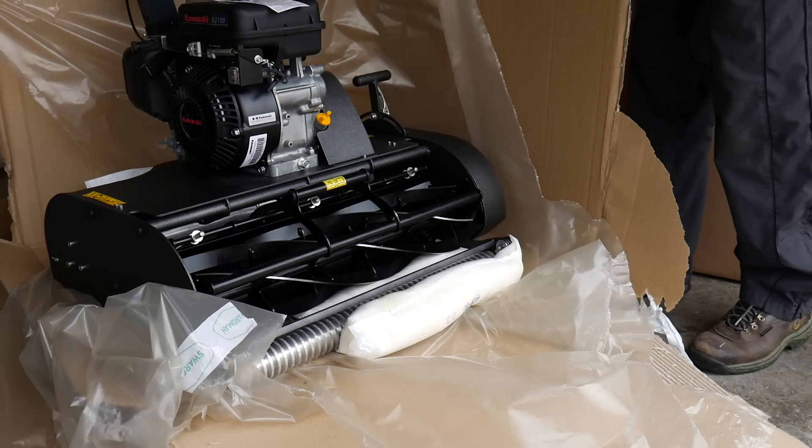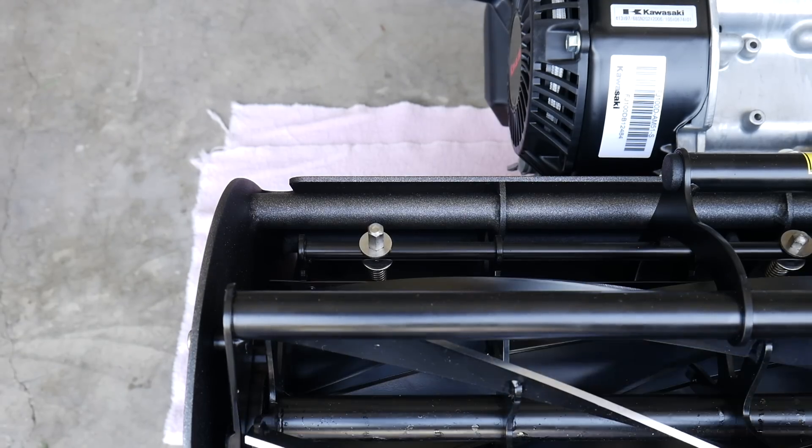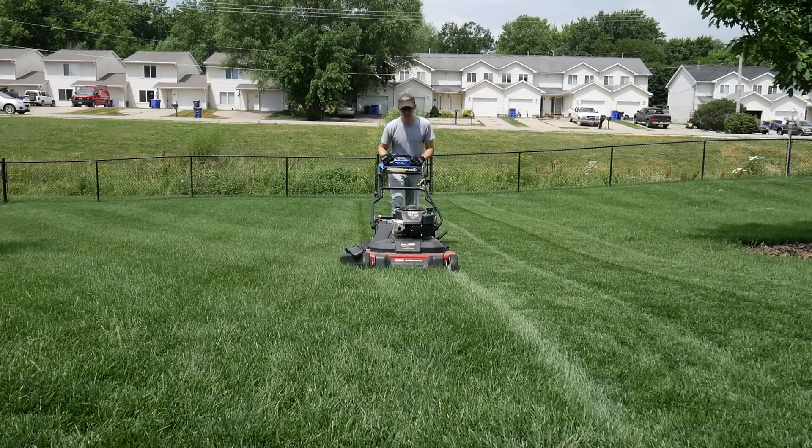One of the first questions I received was: what are the differences between a reel mower and a rotary mower? The way this thing works is we have that reel of blades and a little flat piece of metal underneath called the bed knife. When the reel spins around, the grass comes up on that flat piece of metal and it cuts it off pretty much just like a scissors. A rotary mower spins around and cuts off the grass, but it's more like ripping off the top of the grass with a blade. That's why it's very important to have your blades sharp, but you're still not going to get the same clean motion as a reel cut.